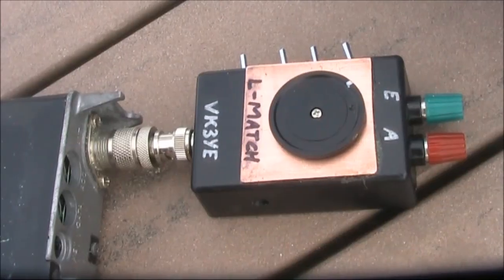The small RF chokes in it aren't necessarily as low-loss as other forms of coil — for instance, air-wound or on an iron-powder toroid. And so I've built another, a bit bigger, but with a much wider range of inductance selection. Instead of just three inductance settings, there are 15, in half microhenry increments up to 7.5 microhenry.